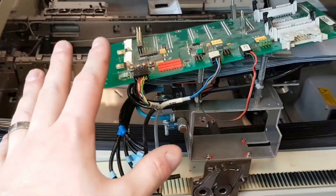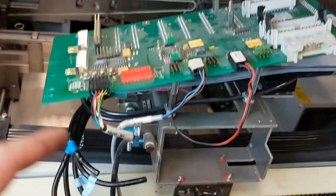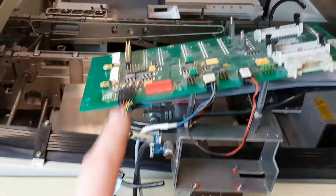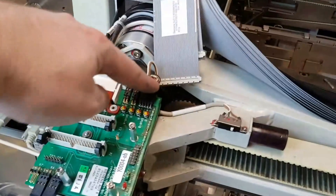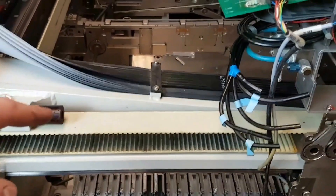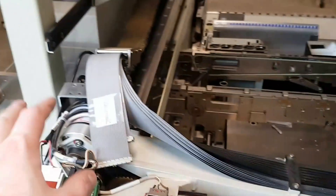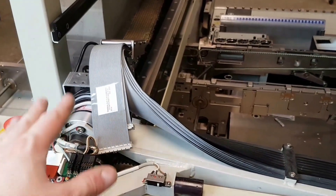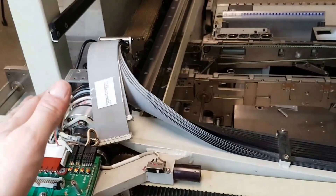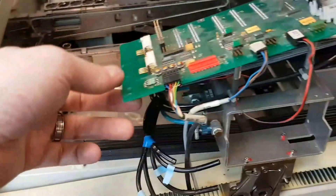We're leaving the electronics on here because this has the Barrow sensor and there's some sort of electronics going on — I haven't probed all of these pins. But this here and this here are going to the same type of sensor, which is my linear axis encoder, which gives me 0.0025 mm resolution quadrature for driving these motors. I need to have a quadrature signal for the motor drive because both motors only output a tacho signal. So I've got to have these original boards still on here.